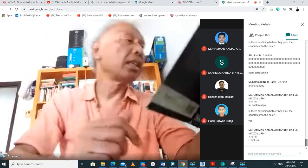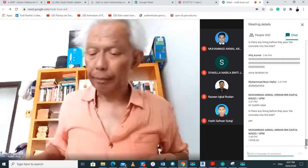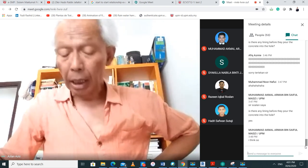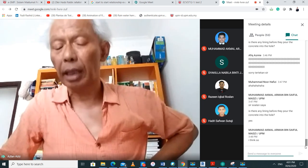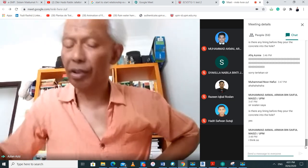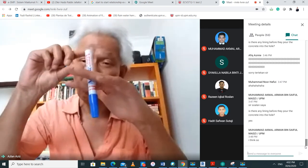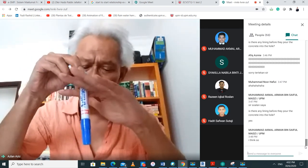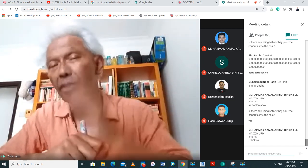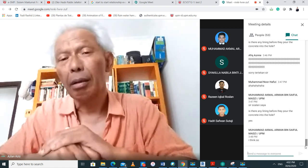Now, it's very good at determining the settlement. So I can do load, I can do unload, and then I can find out the settlement. And I can draw this load settlement time curve, no big deal. The other one is the opposite of what I have. Instead of having a maintained load, I'm going to have the penetration constant. So the pile is jacked into the ground at a constant rate. So I'm going to push it in at a constant rate, and then the continuous load is recorded. It's a bit difficult to imagine, but it's just the opposite of the maintained load test.